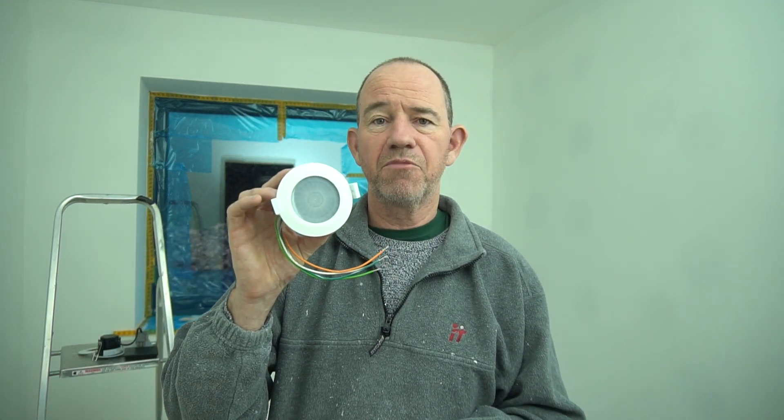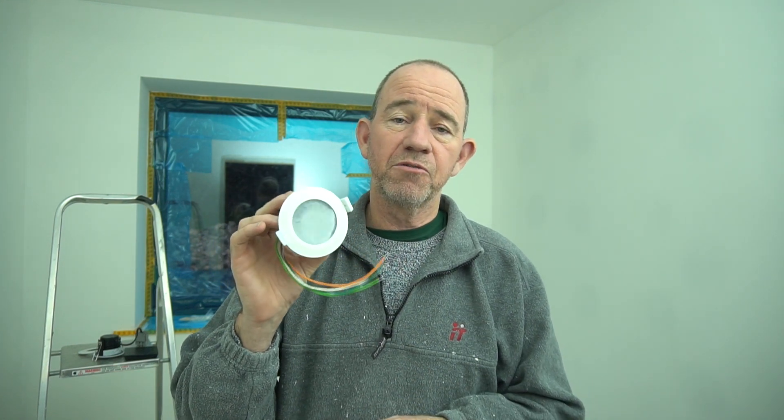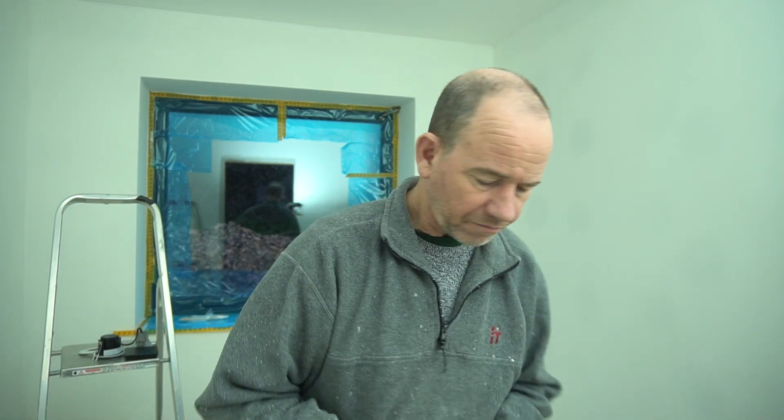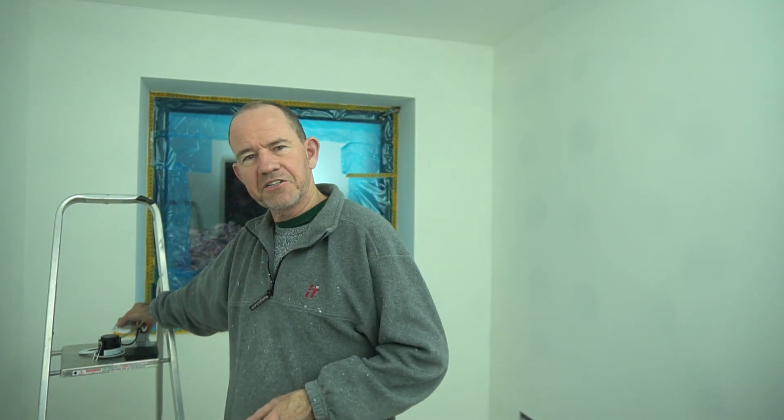To complement those, we've got presence sensors from Loxone. This is a PIR, like an alarm sensor, but it also measures light intensity so we can automate lights coming on and off depending on the brightness of the room. It has a microphone for presence sensing — you'll trigger a scene by walking into the room, but the system will keep that scene activated by listening, so the lights don't just time out. I'm looking forward to seeing how successful that is at presence sensing.